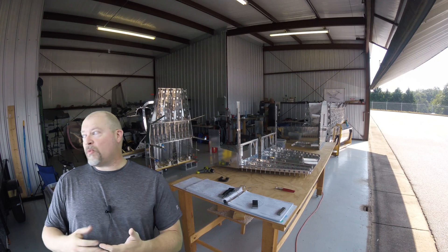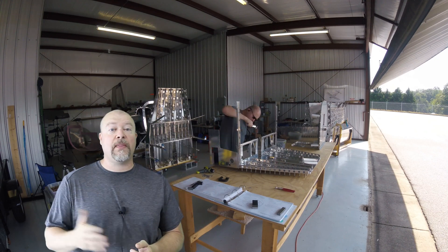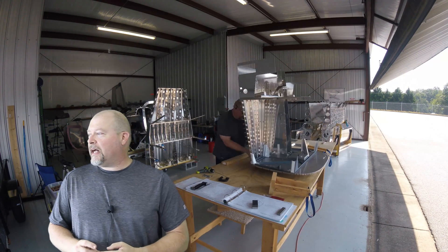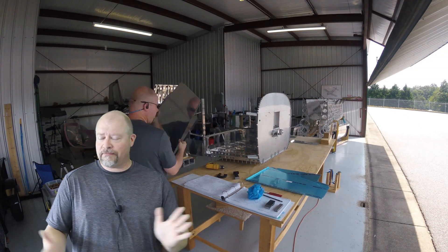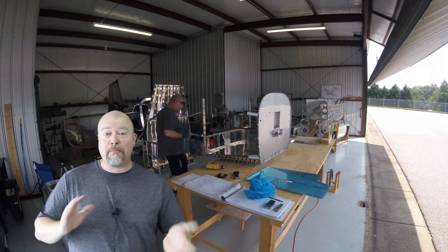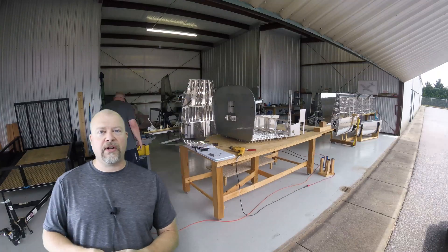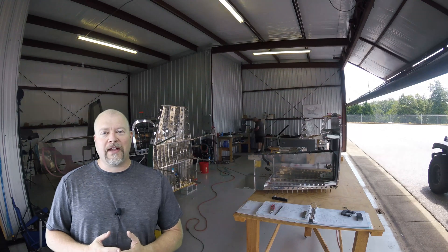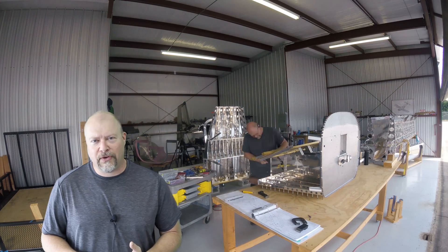In the background, you're probably watching me work on some of the floor plates and ribbing and some of the other stuff that is on the page before the great marrying of parts. Lots of little stuff - match drilling, final drilling, temporarily installing things in order to drill some holes, then you got to take it all apart. There's a lot of that here. It's okay, it's part of the process. Don't shortcut it - don't try to put it together and just leave it together because you're going to end up hating yourself if you do.